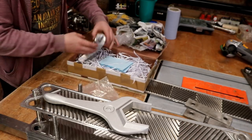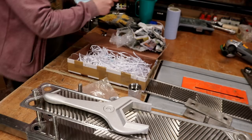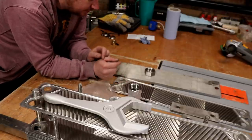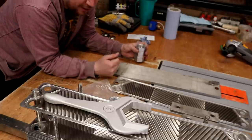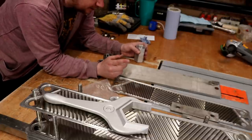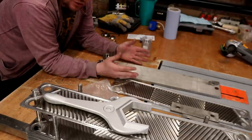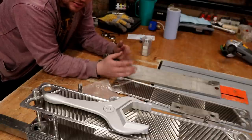That's a bit extra. So we've got the liners, we've got the nuts, and we've got the dispatch note. The plan is I'm going to pop all the gaskets onto the plate chiller, and we're going to blank off the outlet, put water in to the inlet, then go to the other side and test both sides of the plate chiller. I'm hoping I don't have to have counterflow on the cold and hot side - if I test one side at a time and find water coming out of the product side, that means the water is leaking in, vice versa. Anyway, let's get to it.